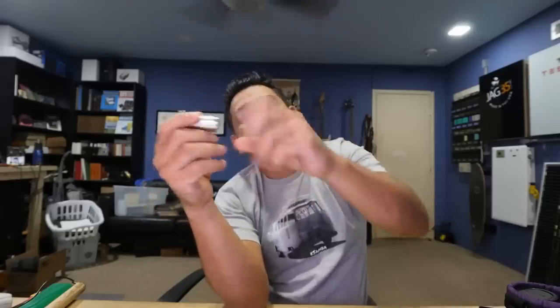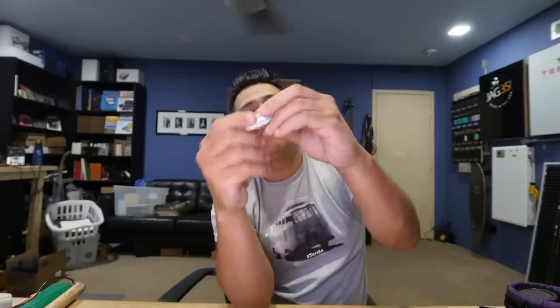So pouches, you actually need to restrict them. You have to compress them, so if you run them hard, they don't separate, because all the layers are just laying flat next to each other, right? On these guys, they're laying circular, and they have this hard casing, so they're actually compressed. So when you run them hard, they create heat and they might gas out a little bit, but the layers don't separate because they can't, because they just create internal pressure.